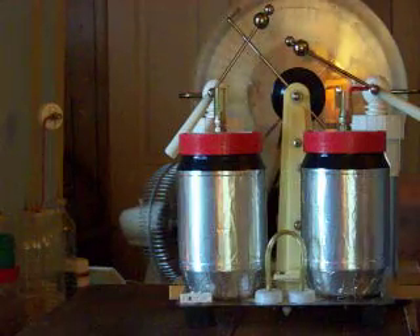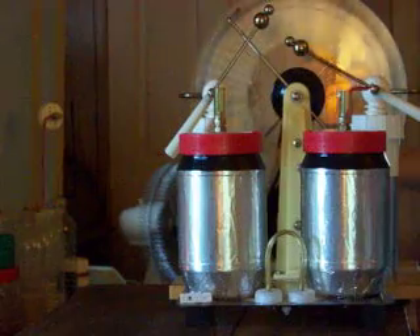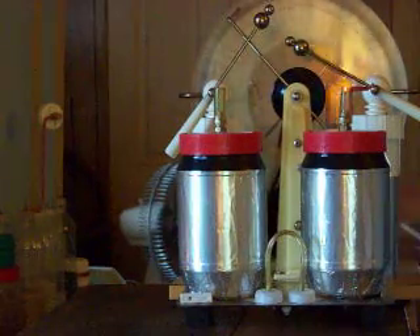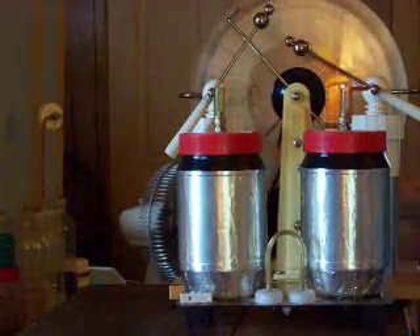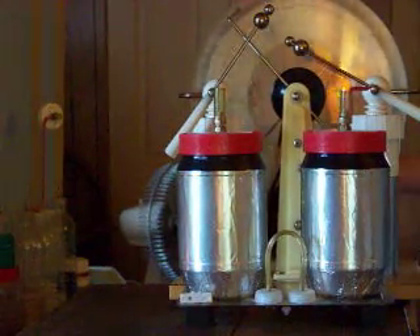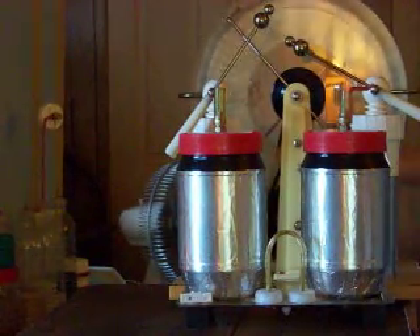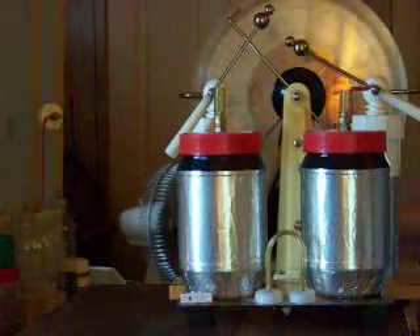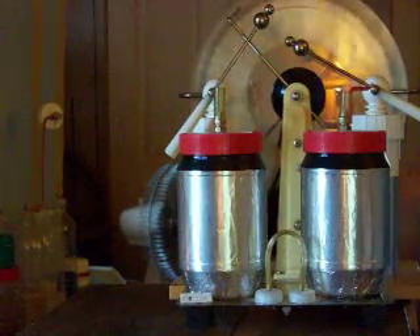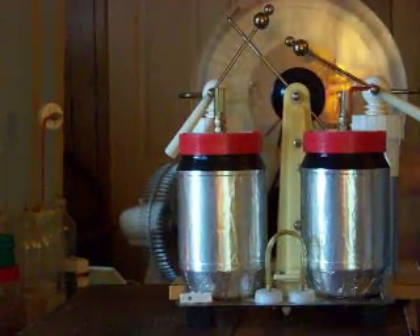You can see how adding the capacitors — these are much larger in area compared to the capacitors on the Wimshurst — means it's storing more. All four capacitors are being charged up, and when the charge is high enough it's sufficient to break down the air. The air is no longer a dielectric or insulator and you have the discharge. That is a class three discharge and it's a pretty good one.